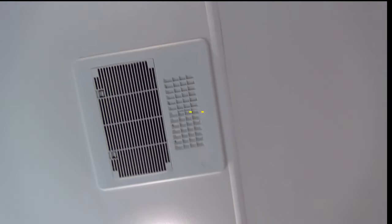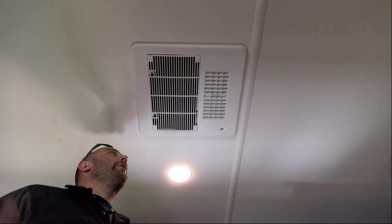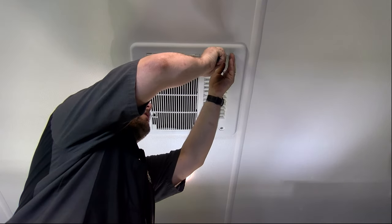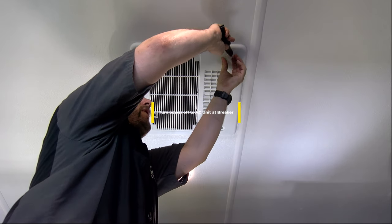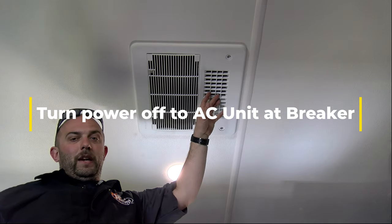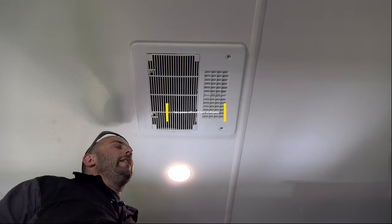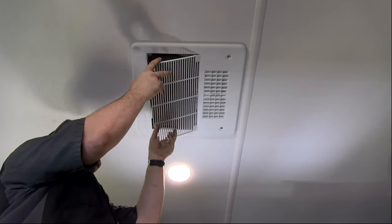We're now doing the make-your-own vent system, and then the last part of the video will be the real RV Airflow unit. I'm going to pop the white plugs out of each side using a pocket knife — a flathead screwdriver would also work. The hot air comes in here and, if the center vent is open, dumps right next to the ductwork. When it's closed it takes the air to the vent system, and that's where we're losing a lot of air. Our goal is to direct this airflow smoothly.